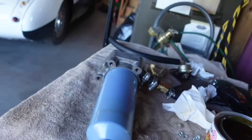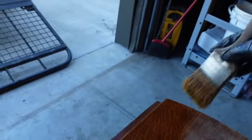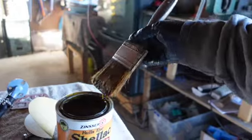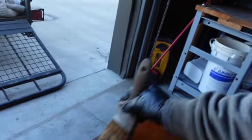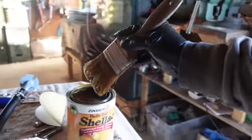I don't see it going much more than this because you see it looks a little lighter now, but it'll darken up, see? Now that's more like it. Just come off like an airplane taking off of a runway. Just don't drag the brush too hard against the back edge and you won't dump any or much. There you go. And I'd recommend that you always sand in between coats. There's nothing there, okay. All right, well, we'll have it up at the house in a little bit.